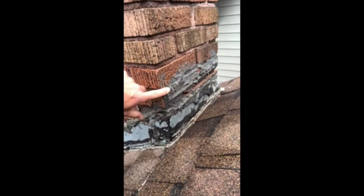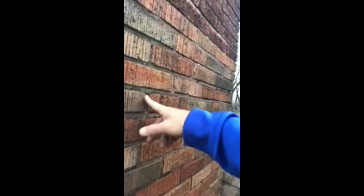Typically we try to go up six to eight inches around it. It's a good idea to have it cut into the masonry, whether into the mortar lines or into a straight line with a grinder. Also, when it comes to older houses with masonry chimneys, tuck pointing — the mortar between your bricks — does get brittle over time. You can start seeing the gaps getting brittle higher up and it's starting to fall out. Pay attention to these areas because they can also cause leaks — water can get into those gaps and cracks and leak down behind the brick and cause water problems on the inside.